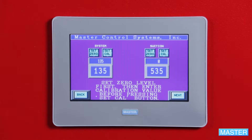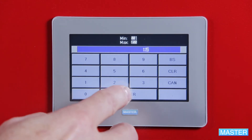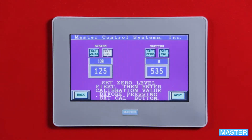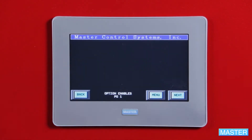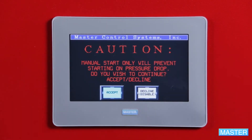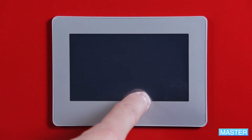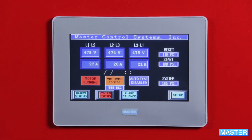To enter the new data, push the bottom box and enter the value from your known calibrated gauge, then push set cal. We now need to re-enable pressure start: press option setup, next, and manual start only, but this time press decline and return to the home screen. Finally, you will need to verify the controller operation with a pressure drop start.